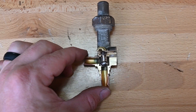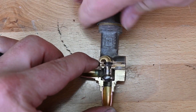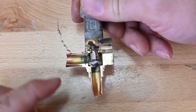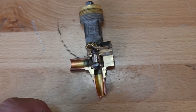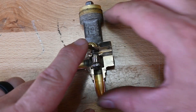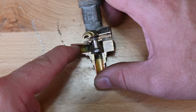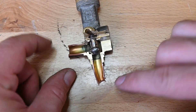Here's another one — it's a little crude of a cut, but we'll take a look at how it works similarly. Right now it is front-seated. This is the liquid line — this port here is completely separate from this port, so it's isolated. This is what you would see in a pump down scenario. This port is open to this port where the gauges go — connected through the threads out to this side — so we could pull a vacuum or whatever we need from this side, but this side over here is closed off.